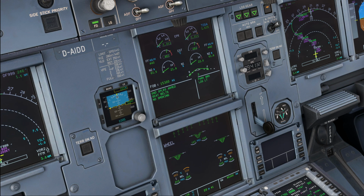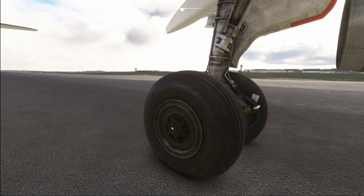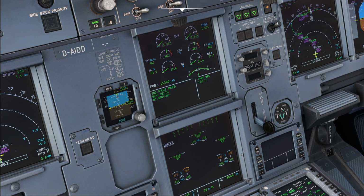And remember, the reason for that is that the brakes do heat up in the inner part first, and then that heat slowly spreads to the outside where the sensors are located, which is what we are seeing down here. So we're reaching 500 degrees Celsius on our left wheel right now. That's the wheel located over here. So let's go ahead and turn on that brake fan.